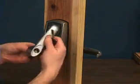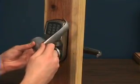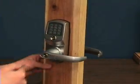Fit the key cylinder into the back of the handle and then insert the key through the front. Slide the unit into place. Turn the key to the right to unlock the door and tabs, and then push into position.